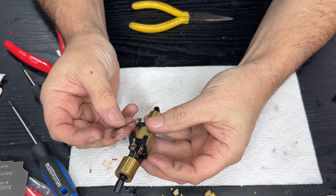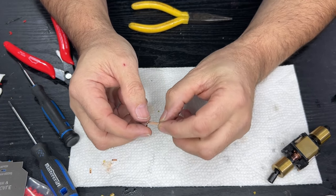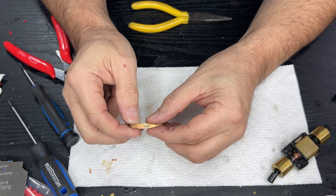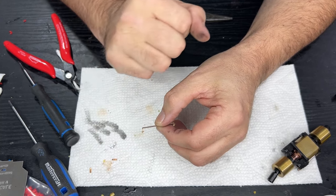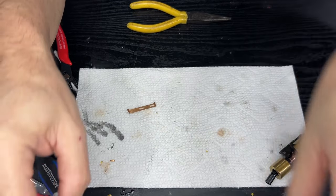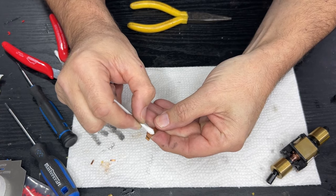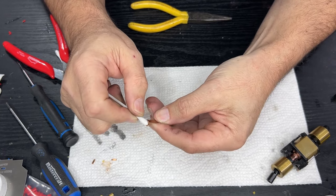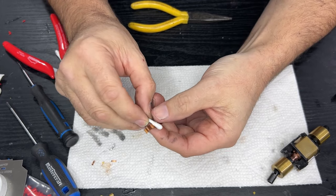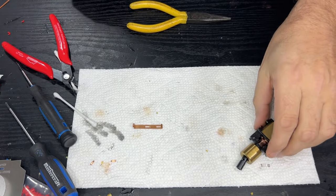Next step: I want to solder on a little bit of wire. What color and why is that important? Well, this is going to be getting the power signal from the decoder, and we've already established the two colors we need from the decoder are gray and orange. So I'm going to make this bottom one gray. I need to find a bit of gray wire and get this soldered on. I'll clean the contact to make sure we get a nice connection, because once this is soldered we won't have easy access to it. I want to put the solder point right at the edge there, keeping this section as flat as possible.